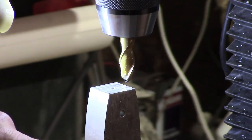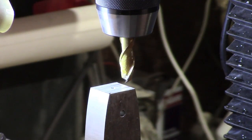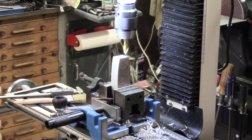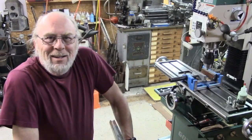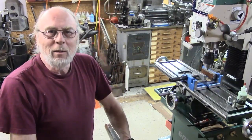There's a bit of a cheat here — the saw cut I had at this end had a little bit of surplus, so fortunately I've just run the mill across to square that off. I've used the old trick of a vice within a vice — it doesn't have to be super accurate, I just want a decent flat face on there for the butt hook to fit on. I've already got a centre hole in here so I can take it straight over to the drill press and put my tapping drill through.